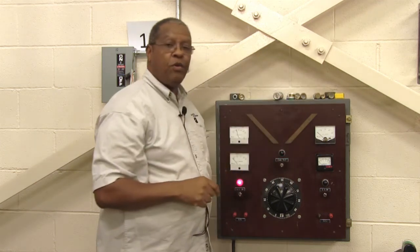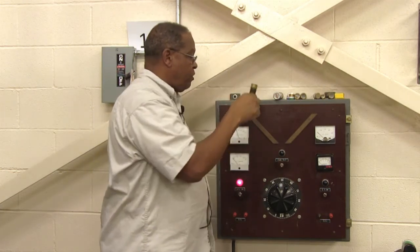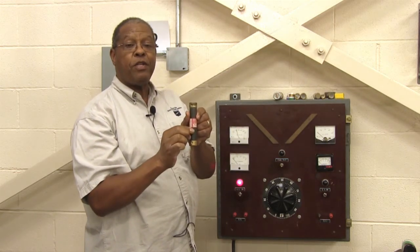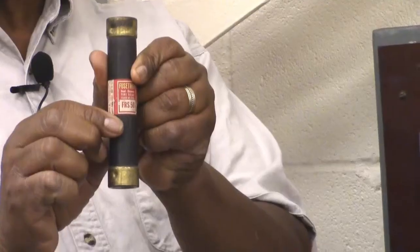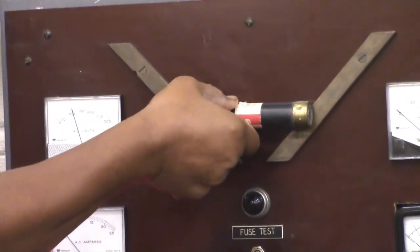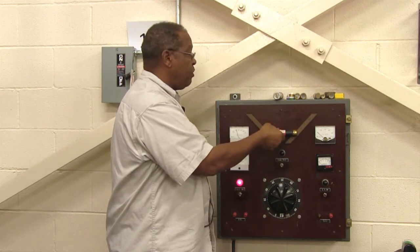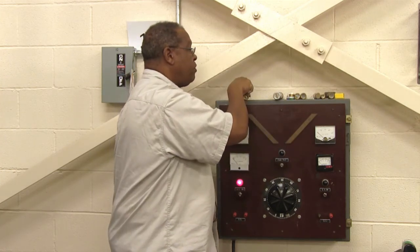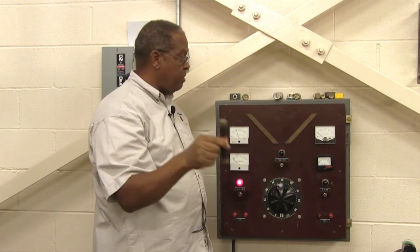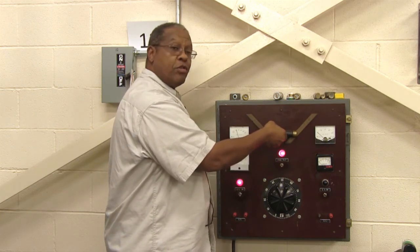To show you what happens with a bad fuse, here is a fuse rated at 50 amps. I'll test this fuse to see if I get a functional reading. I touch the two copper bar ends and you can see there is no light — so this fuse is obviously bad, it is not a good fuse. Just to prove the tester is still functional, I'll retest the good 60 amp fuse — put it on there — and you see the red light. The red light indicates the fuse is good.